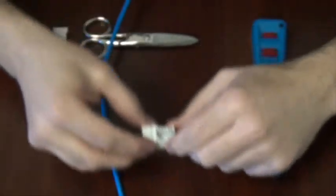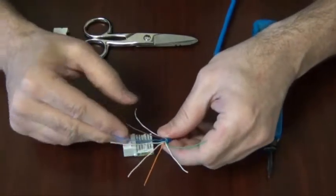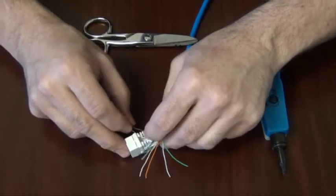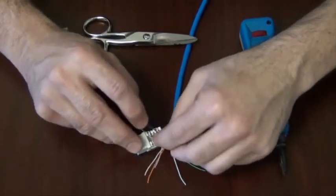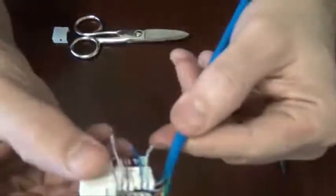Okay, so we're going to lay our insert down, put in place for you here. And I'm going to lay the wire in place first, then I'm going to use my punchdown tool. So here I'm going to put in the brown wire. And then I'm going to put in the brown and white wire. I'm going to give you a close-up view when I'm done with this side so you can see what I'm doing. Then the blue wire, then the blue and white wire. As you can see, I've tucked them in the little grooves, in the proper colors